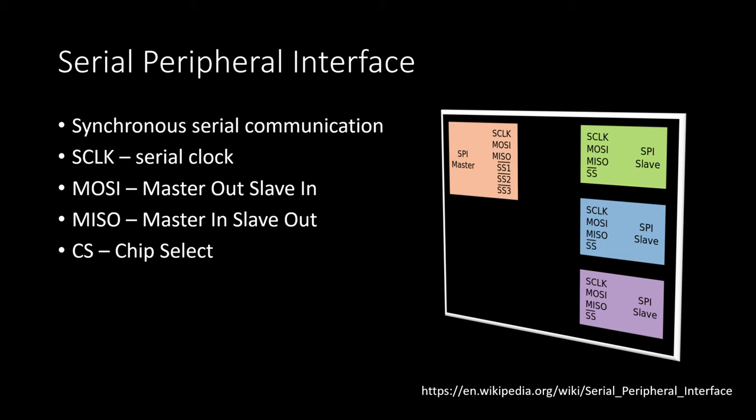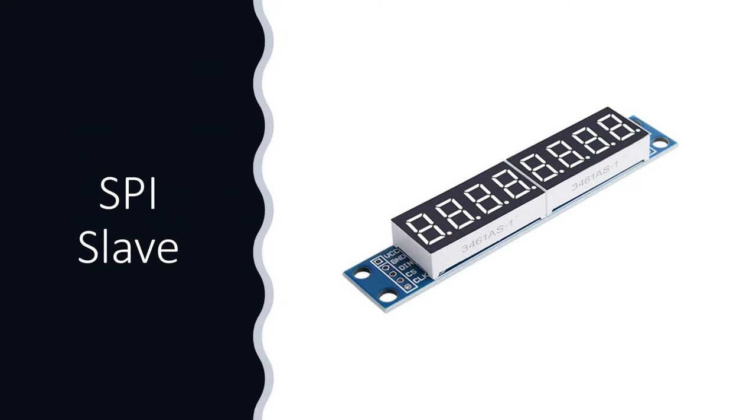For my initial work I wanted a simple way to do SPI testing. For my first SPI slave I'm going to use a little display - an eight-digit seven-segment display driven off SPI. In this case I can only send data to it; it does not send back any data. This is really half of the equation. Later I might add SPI devices such as an SD card or flash ROM connected through SPI, and I think flash ROM might be the next device I try.